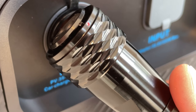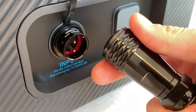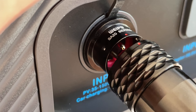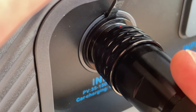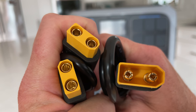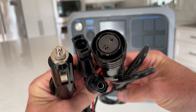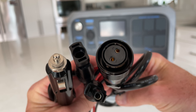Let's talk about the aviation cable. This thing is beautiful — I've never had this on a solar generator before. It's machined aluminum, anodized, with a really nice spring-loaded quick release. All you have to do is slide it onto the connector, it'll lock into place with the locking ring. Then you take the male XT90 end and plug it into either solar or the car charger. Very simple and very strong.